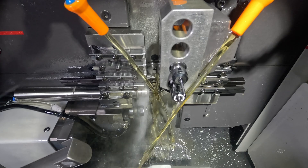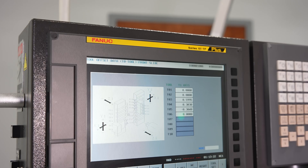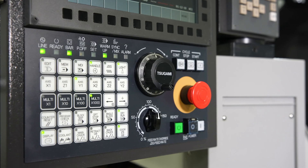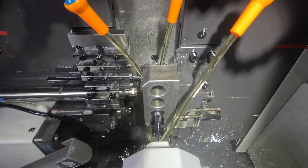Polygon turning is also capable with the gear-driven spindle. This machine also comes standard with linear scales on X1, X2, and Z1. Coupled with the linear motors, this essentially eliminates any kind of thermal displacement issues and really allows us to keep that accuracy and repeatability on these micro parts.